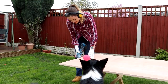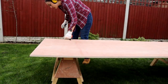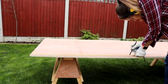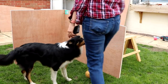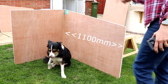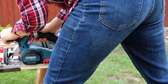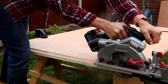While I was sanding, Hans thought he'd help with a ball. I needed to measure the tallest side of one of the side panels, and it was very important I transferred this measurement on the outer side of the ply because that was the tallest area of the bevel — this is the front panel and I'm measuring from the back of it. It's always best to make something bigger rather than smaller because it's easier to deduct than add. I thought the kennel was just far too big for Hans, so I reduced the front panel's width to 800mm and the side panels to 1100mm, and decided a 40cm width opening was perfect for him. I then remembered the track attachment, meaning I only had to set it up once for two matching panels.